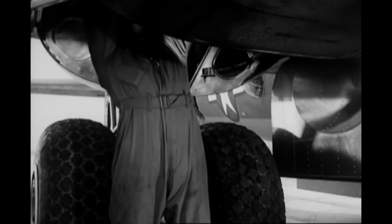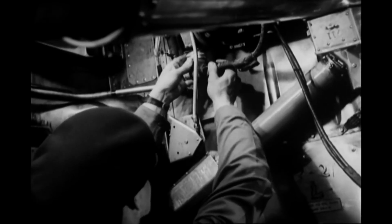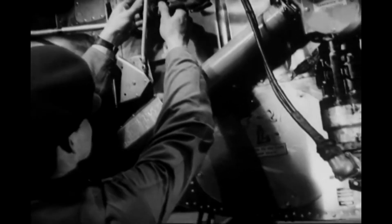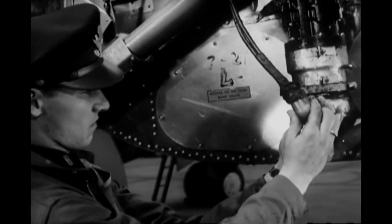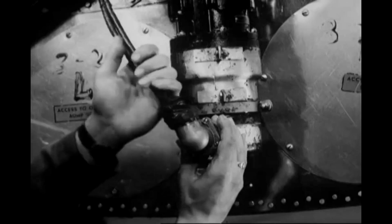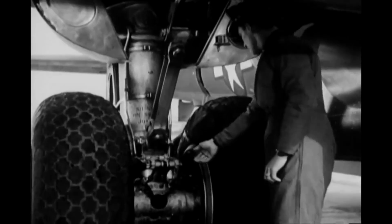Inside the wheel well, the co-pilot examines the wires, connections, and switches. He makes sure all the cannon plugs are on tight, paying particular attention to the plugs on this motor, which opens and closes the nacelle doors, and also to the plugs of the normal and emergency landing gear motors. Then he turns around to examine his side of the strut.